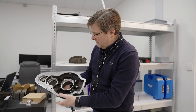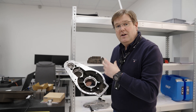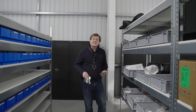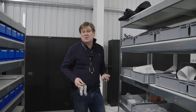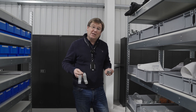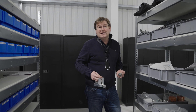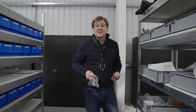And then again on the inside, you can see we've dressed the flange faces, and all of these critical pickup dimensions have been machined to the tolerances we need to be able to hold everything precisely where we want it for the engine. With the exception of the last couple of big fabrications, which are due in on Monday or Tuesday next week, we've now got all of the bits and pieces that we need in stock, ready to build the speed reduction gearbox test rig. So over the course of the next couple of weeks, we'll make a start on putting that rig together ahead of the completion of all of the speed reduction gearbox components themselves, ready to start the testing.